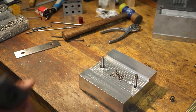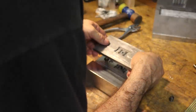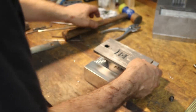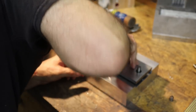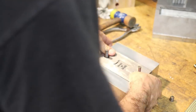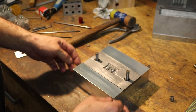So let us see now if we can get our stripper plate to drop down there correctly. And this is the orientation. There's two circles that are offset in the features. Okay, it's normal for it to kick back and forth like this with high precision alignments. It's feeling better. All right, look at that. Okay, so now we've got good motion, I believe. How about now, it wants to jam up, the clearance hole isn't quite enough. Oh, there it goes. Just had to convince it. Okay, there we go.